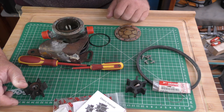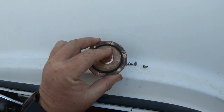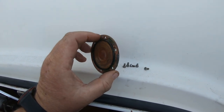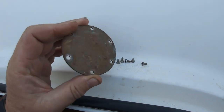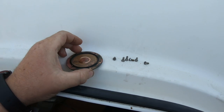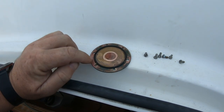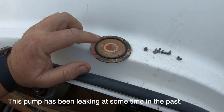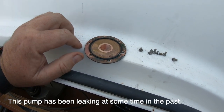Let's show you what it was we did. That's in pretty good condition too. There's some slight wear on there, but nowhere near like there was on the other one. And you can see the O-ring still actually attached. So this one, no writing on this side, so probably a pattern part. Nothing wrong with that. It's just a bronze plate. You can see this pinky colour, which means that there's a bit of de-zinking gone on. So I think this one might be more brass than bronze.